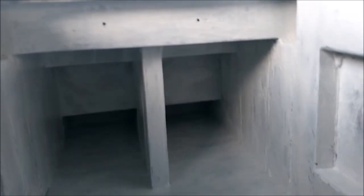The inside back of this hull is the most difficult part — my wife has to get back there because she's small enough to reach in and paint all that. She did pretty good. That's a long reach back there. We need to get this one really good because our drain is right here — it drains back to this side. There's no drain at the very back, so if water gets back there and the back of the boat is down, water stays there. We want that to be a waterproof area.